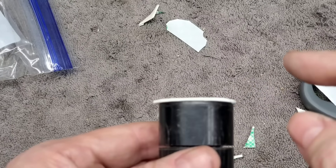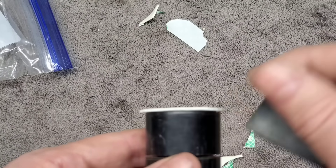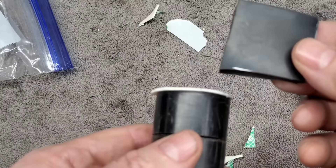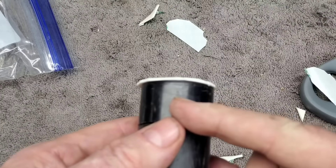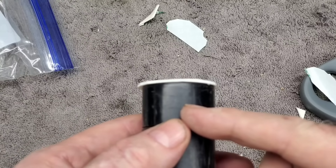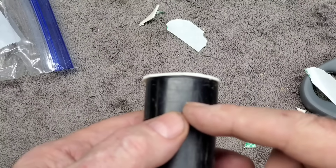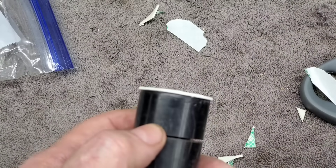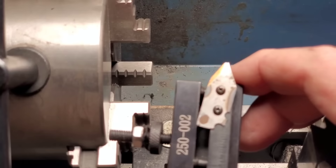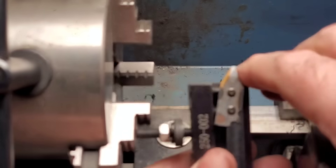There are thinner double-stick tapes out there, but you're cutting it really close — the difference between cutting through enough versus cutting into your round stock. If you're working with a razor blade with a piece of steel round stock as your backing, you can instantly dull out the razor blade. So it's good to have something like Delrin or even aluminum, something that's a little more forgiving on the razor if you were to cut it too far. This is the tool that I made — you can make one too. All you do is start with a good sharp razor blade and you trim it like I have here.